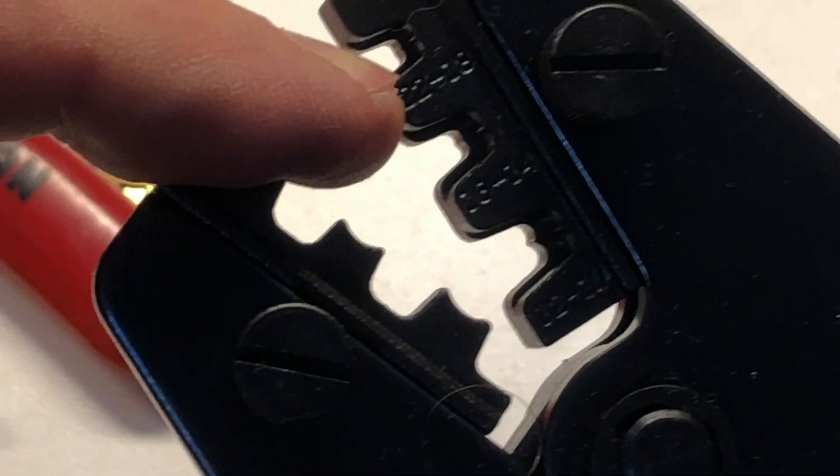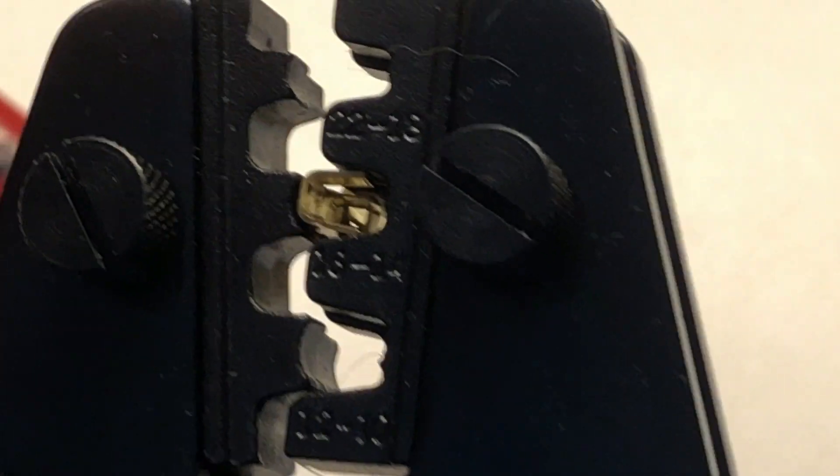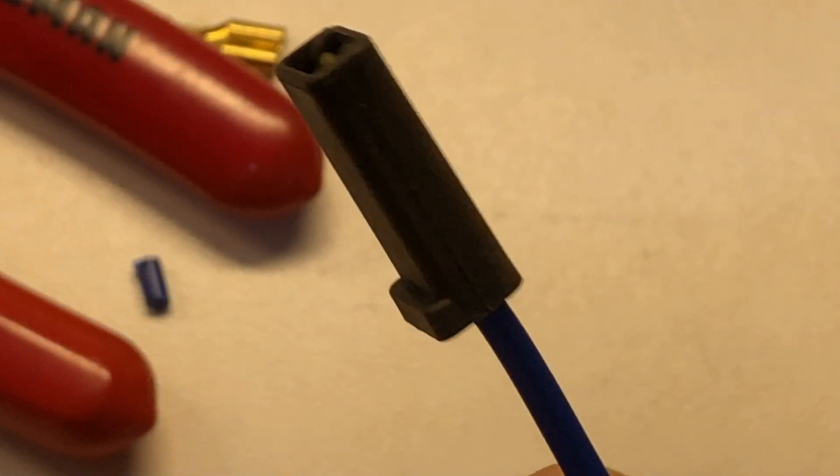Then to use the tool, we just select one of the sizes on the die that's corresponding to our particular terminal. This middle one looks like a nice match for us. We can just lay it in there and get it started like that. Just don't crimp it all the way until you're ready - put your wire in on this side, and then you can see on this side if you've got it in the right position. As soon as you're sure you've got it in the right position, go ahead and finish it the rest of the way. Let me get this at a good angle where you can actually see the crimp action. As soon as it goes all the way down, just release. This is a wider type of insulation but it's still crimped just fine. Now we can just pop this on to a terminal block and we're ready to reinstall it back into the application.